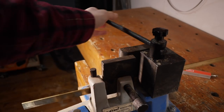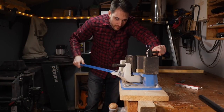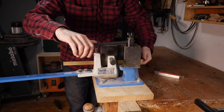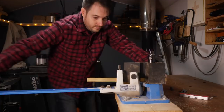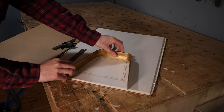I get the bar in, lined up with my marks, tighten down and then I can make the first bend. With the first angle done I can flip the piece around and repeat it. This machine can bend up to 5mm thick steel so this brass was no problem for it whatsoever. I made two of these for the stand and they came out pretty close to each other.